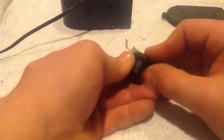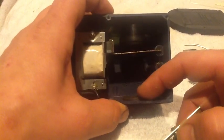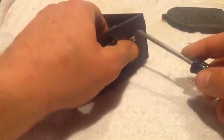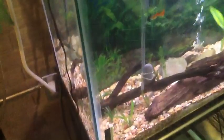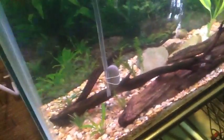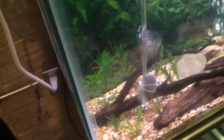Then get your gasket put back on top of your air cylinder and reassemble. Make sure all your air pumps will have a gasket on the bottom to cover up this end of it. Mine's glued in, but I've had other air pumps where the gaskets fall right out — they're not glued in — so just make sure that bottom gasket is in there because that'll seal it off. Get your pump put back together and you're ready to go. Got my pump put back together with an airline running into my breeder tank with my guppies. There we go — working good. So there's one solution.